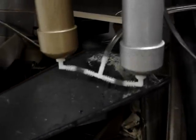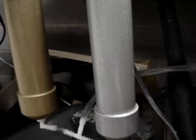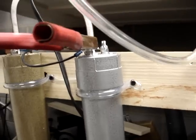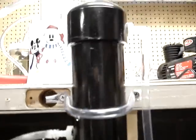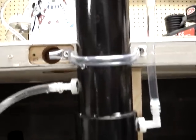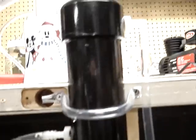With the fluid migration system, the cool electrolyte comes down to the very bottom of the reservoir and goes to the bottoms of both cells via the T-fitting. As the warm electrolyte rises to the top along with the gases, it is expelled through this tube and up to the side bubbler fitting.